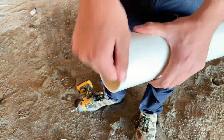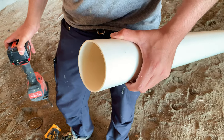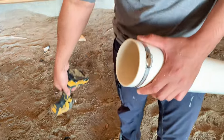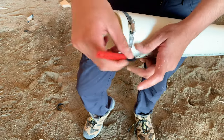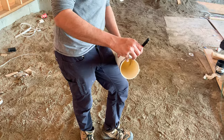This technique is good in the beginning, but could consume a lot of time. Your employer might not appreciate the extra time being spent on cutting pipes. For efficiency purposes, it is recommended to practice cutting without the clamp. People normally start by using a clamp or wraparound method to mark around the pipe and follow the mark while cutting.